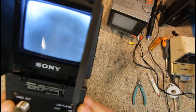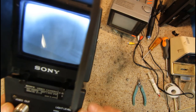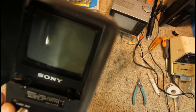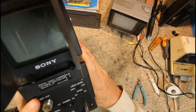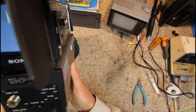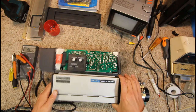Supposedly you can't actually record these cameras on a VCR or DVD recorder — not that you'd really want to these days, but some people seem to be using them for retro work. There's a bit of burn on that screen — looks like a door frame or window frame, something arched. If a camera is left pointing at a bright image, the bright parts will burn in, leaving a darker image on the phosphor, and if it's burnt enough it'll show up even just from external light on it.